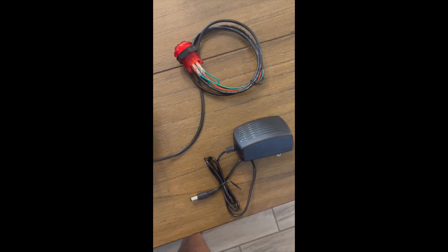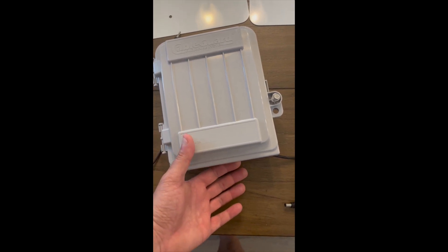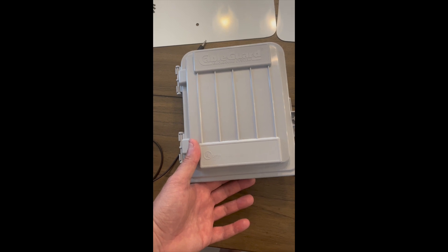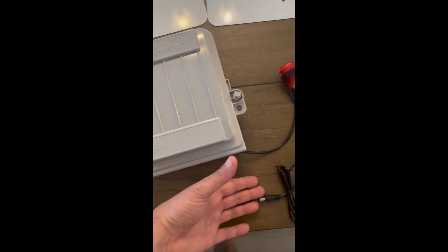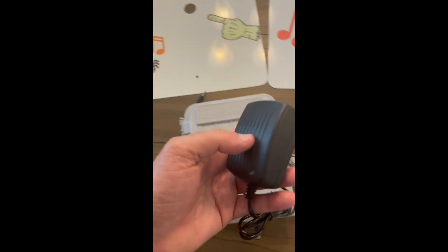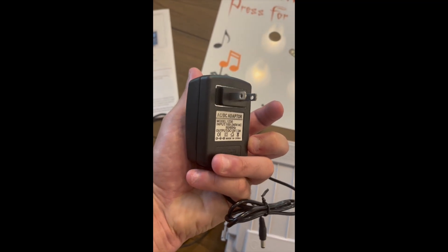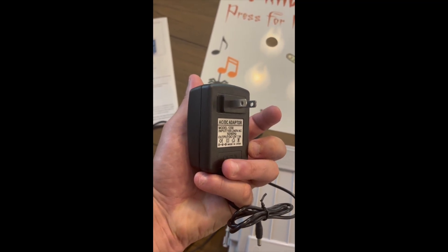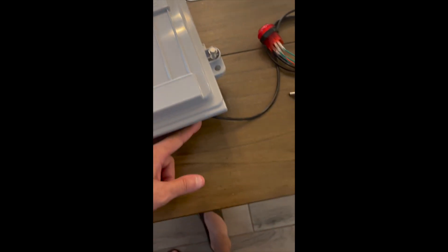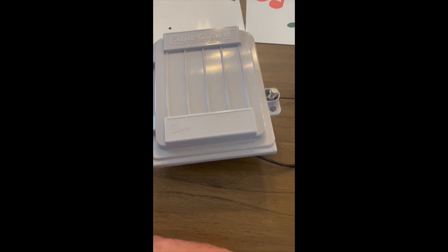I currently offer two types of methods to power the push-button setup. If you have a 12-volt display, you can choose the X-Connect option to power the push button through your power distribution. If you do not have 12 volt or don't want to power it through your show's power, you can power it through the AC adapter option upgrade that is available. The AC adapter will plug directly into a household outlet or extension cord to power the setup. If you choose the X-Connect option, you will have a pigtail coming out the bottom of the enclosure to plug directly into your power distribution.